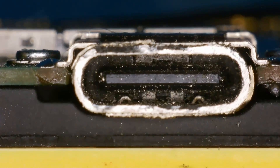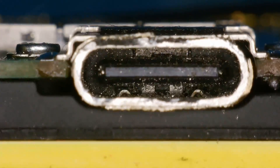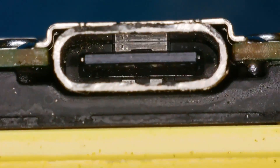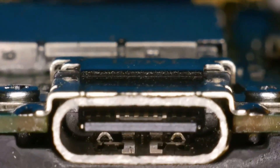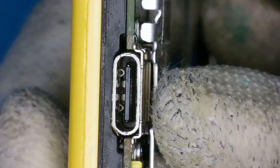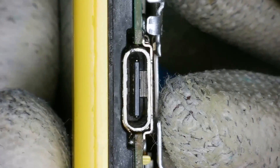It doesn't look horrific. Looking inside the port though, you can see all of the metal shards — metal is conductive and we don't want anything shorting out, so we need to get all of that out. After cleaning with IPA and a toothbrush, it's come out 10 times better than expected with hardly any metal shards remaining. I did some fine tuning off camera because it wasn't quite fitting the case, but now the edges are smooth and there are no metal shards. Let's put the shell on.